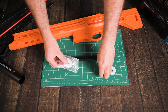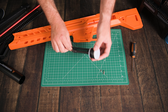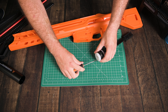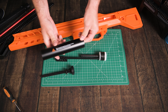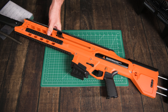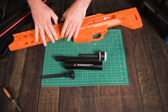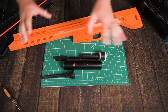The first thing we're looking at is the bolt assembly. Mine came assembled, but it's just two screws — one at the front holding the priming block to the priming rod, and a second screw on the plunger cup holding that to the priming rod as well. We also need the bag with all the buffer paddings. They've supplied multiple — over time as the plunger rams into the back it'll squish down, so you can swap it out. Grab one of those and four screws, position it on the back of the plunger cup, and put the four screws in. Do the two opposite each other first, then the remaining two. With it screwed in all the way it should look like this.